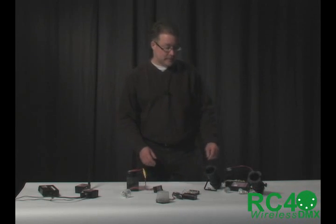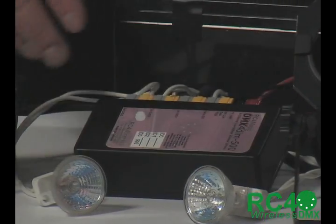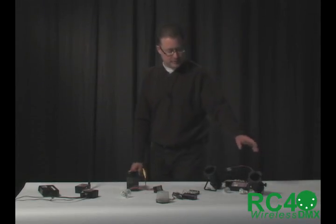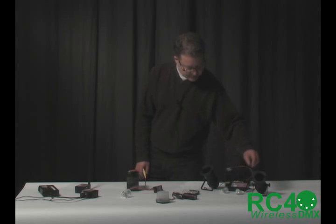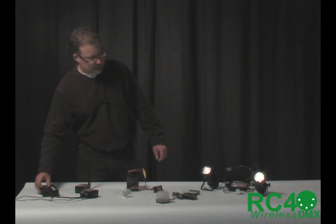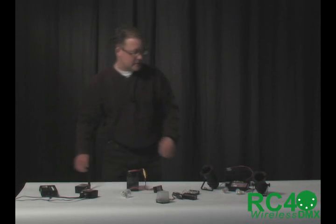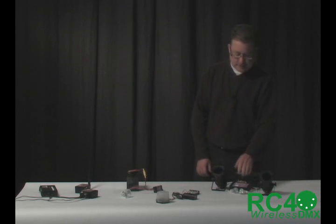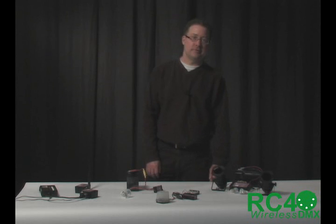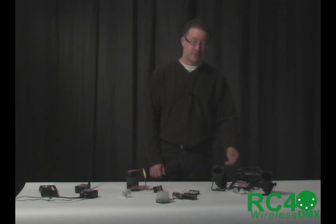Sometimes you'll want to have more power, so we make the DMX4dim 500 — it's a 500-watt dimmer, 500 watts shared over four channels. Here I'm showing that with two MR16s in little canned fixtures and two MR11s, giving us a lot of light that we can, once again, control in real time. If you do a little quick math: a very common 50-watt MR16, with 500-watt capacity in that dimmer, you could run 10 of those 50-watt lamps off of that dimmer. If you need even more light than that, you could run two of those dimmers in a single piece.